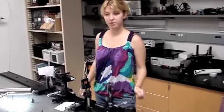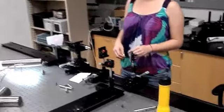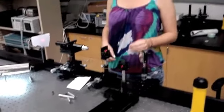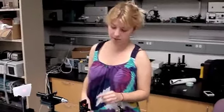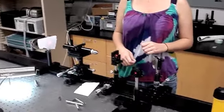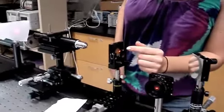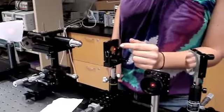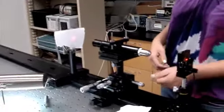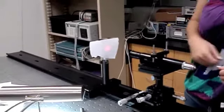As part of the lab, we found the longitudinal spherical aberration, and so to do that we had to find the paraxial focus compared to the marginal focus of the lens. Now, the paraxial focus is a bit hard to find because when you have the laser passing through the center hole in the Hartmann mask, it is already at paraxial focus. So what we did is we started at an outside one and slowly brought the laser through each hole, and then brought the microscope forward or moved it along the rail so that our spot was at our original position.